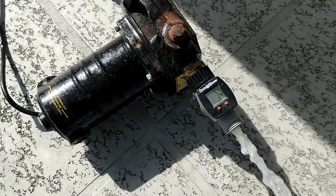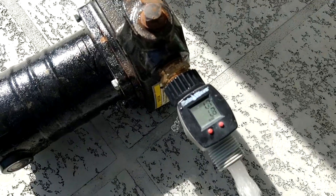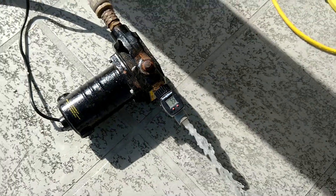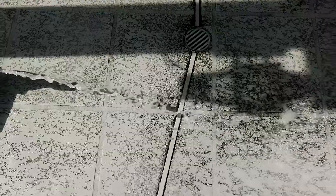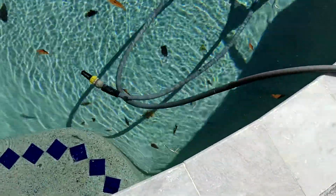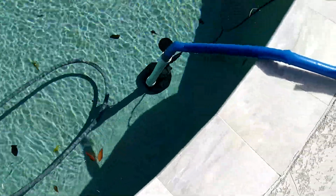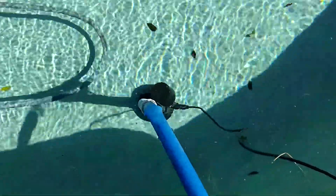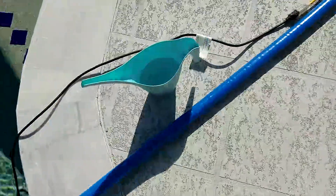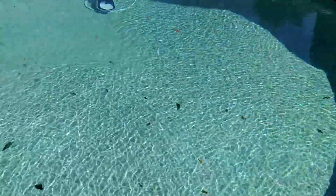A few years later, we're back looking at this pump and I decided I'll measure the flow rate. There's two gallons there. Unfortunately this thing is not very fast — I'm guessing four gallons per minute. All we've got is maybe a foot of elevation above this intake hose right here. We've got this nice one and a quarter, one and a half inch sump pump that's really moving a lot of water, getting the pool down so we can do some plumbing work.